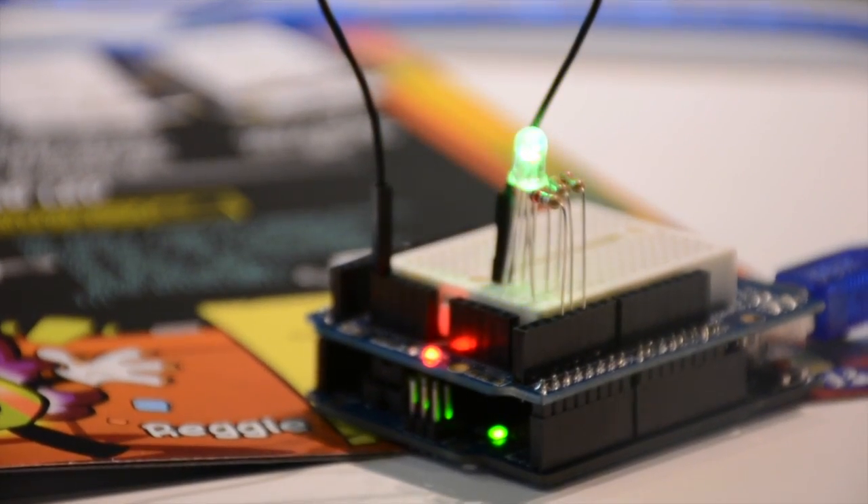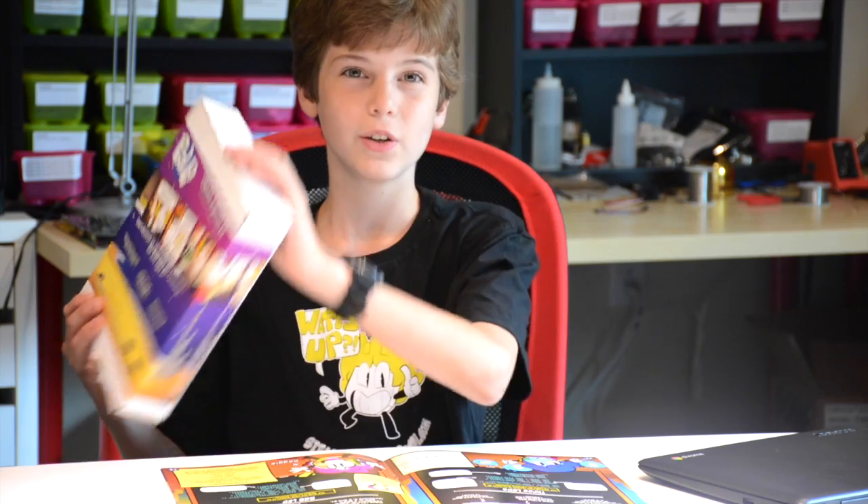In order to do this, we need an Arduino and an Arduino prototype shield. We need an RGB LED. We need three resistors — 220 or 330 will work perfect — and a black wire and a computer. If you don't have any of these things aside from the computer, you can go to our website podpie.com and buy a kit. They have everything you need.